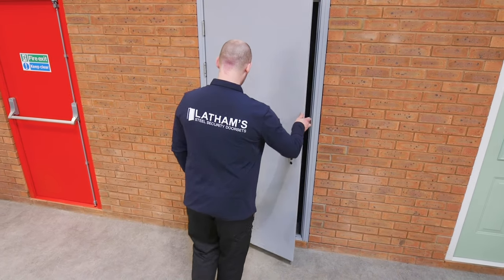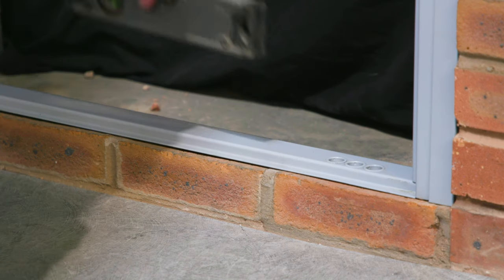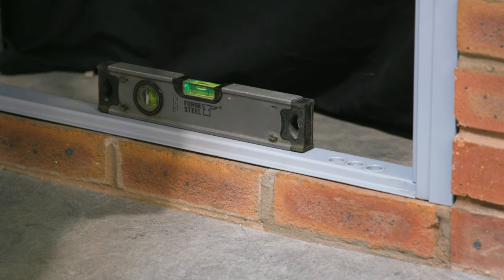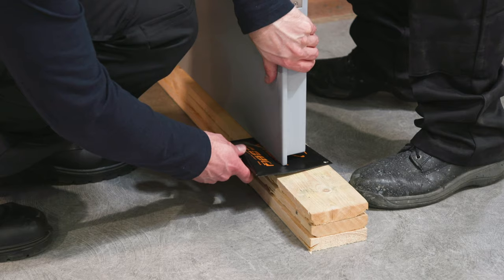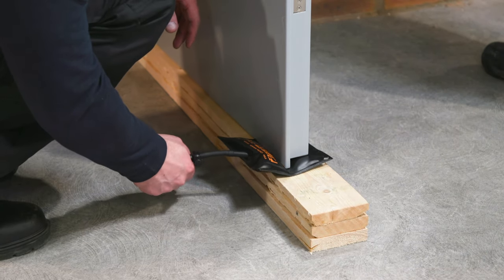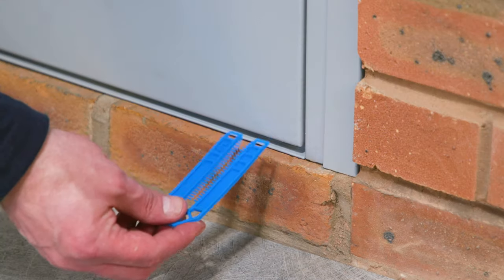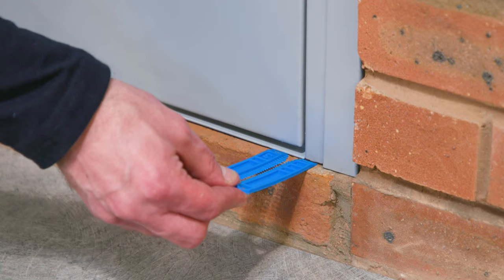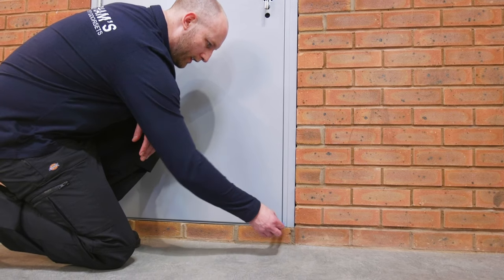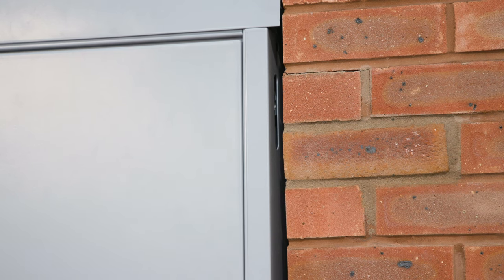With the door frame in the aperture, check that the frame is sitting plumb horizontally using a spirit level across the threshold. If you are using a wind bag, position it under the door leaf and inflate — this will help lifting the door to position in the aperture. Use fitting shims to lift up either side of the frame if necessary. If you are experiencing any issues with spacing around your door, please see our video on spacing around doors prior to fixing.